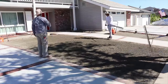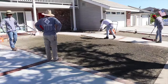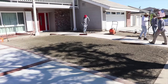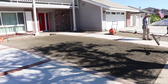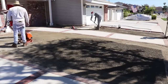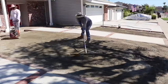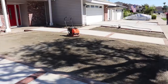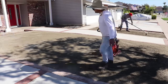So before we do start laying any artificial turf, we are just fine tuning the 1/8 crush aggregate that we brought in. We got grain rakes out, and we just need to compact it now and then wet it, and that will really consolidate and really compact and bring it all together. Plus, it's also nice to lay your turf out in the sun, let it stretch out while we compact and get everything else ready.